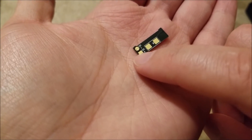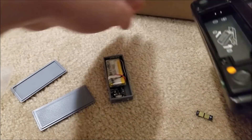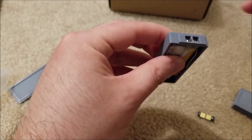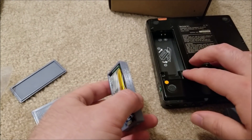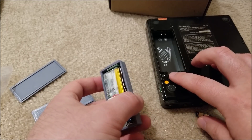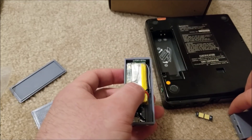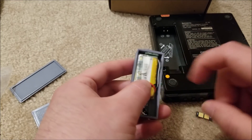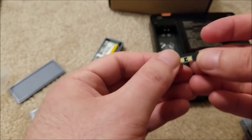You can see battery plus and minus clearly, and I put a spot for a diode. The issue is: if you charge it externally via USB there's no problem, but the battery is directly in parallel with the contacts. If you plug into a wall outlet while the battery is inside, the nickel-metal-hydride or NiCad trickle-charging circuit will try to charge this lithium battery. Without proper over-voltage or over-current protection, that could swell the battery. So I added the option to include a diode to prevent current from flowing back into the battery.